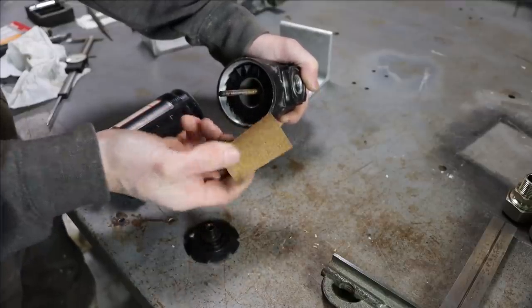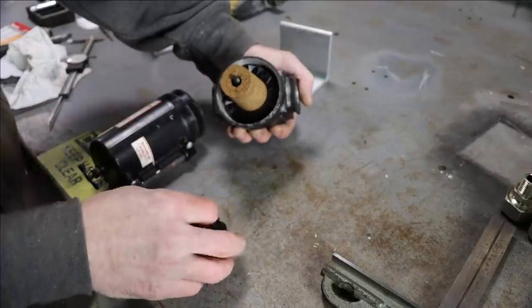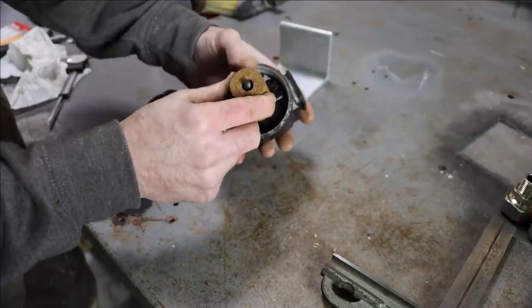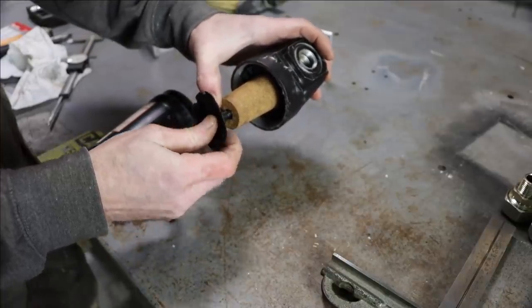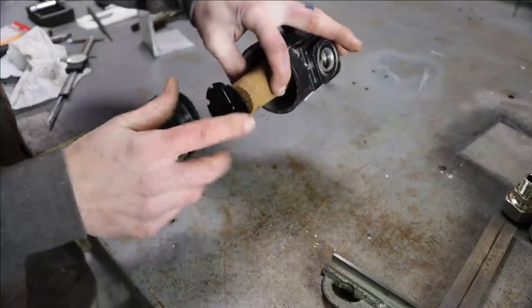There's the bronze sintered filter. You can see how those vanes just spin the air, and it falls out into the vessel. Now, I already changed the O-rings on this, but I'm going to take it back apart and put a little vacuum grease on all of them to help them seal a little better. That's pretty much it. It's my best understanding of this thing anyway.